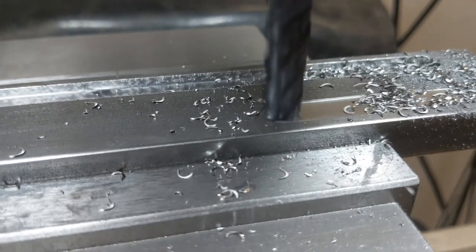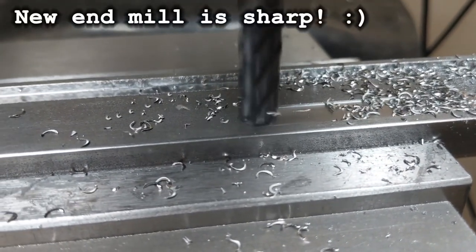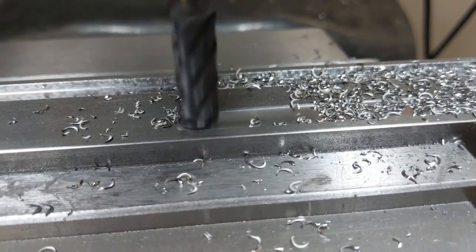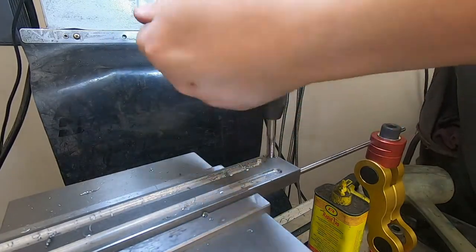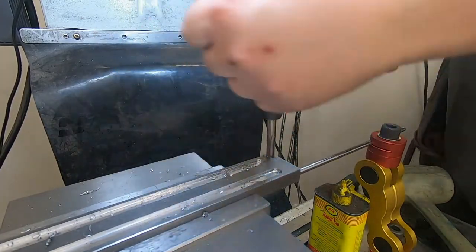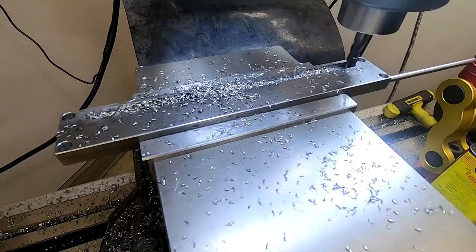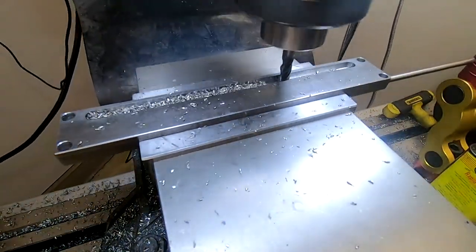I made it out of half-inch cold roll bar, an inch and a half wide. The lower piece had two shallow slots this time, so the previous embossing could sit in the second one and set the spacing. The lower piece also had tapped holes so the upper guide could be screwed down onto it, keeping alignment correct and clamping the sheet metal into place. The upper piece still just had a slot in it, but much thicker this time to guide the moving punch better.